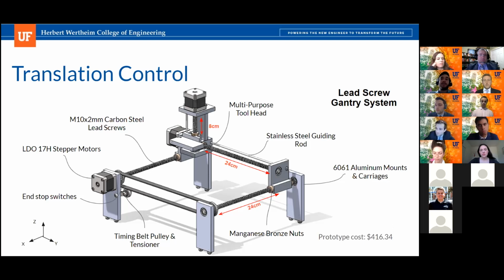So in this case, I was also thinking about that. What we're going to do is have a belt with a steel backing in it, so it has a bunch of steel wires that run through it, kind of like a car's timing belt. That way there's none of the sponginess or deflection that you could have with the belt, and it would keep itself always aligned.